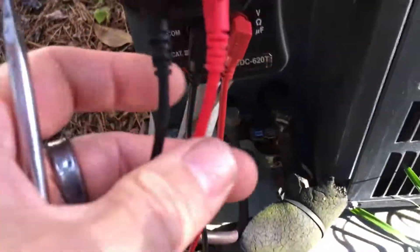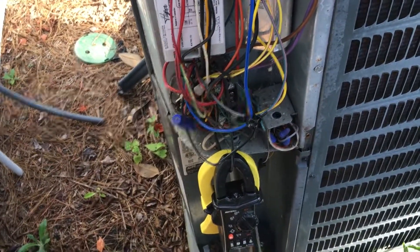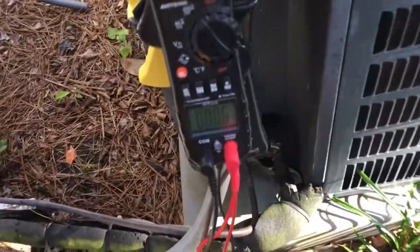I've mounted the soft starter and got both meters hooked up and ready to go. When I plug this knife switch in it'll come on and we'll be able to see how much it reduces the startup amps. They recommend starting and stopping five times, so since it's a hot day I'll put it in run mode and check back in about an hour — it should cycle five times through. We'll get our first reading and then a final reading. I'm going to go ahead and put the knife blade in now and get a recording.